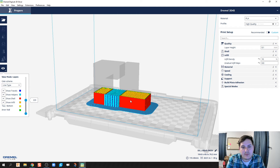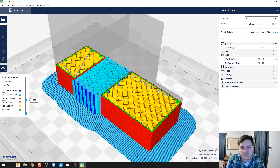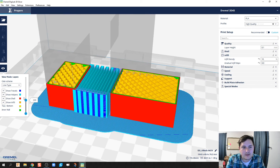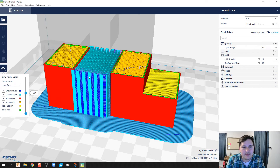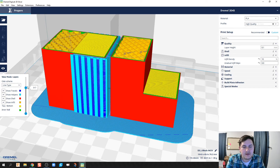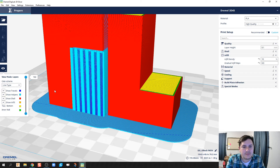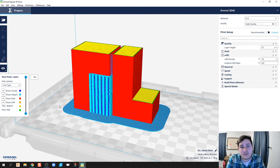If I click Prepare, the slicer will slice the model layer by layer to tell the 3D printer how to work. If I click the view mode and show layers, we can see as the printer goes up: there are the first support layers, the first adhesion plate layer, and then good adhesion. As it builds up, the red is the outside surface, the yellow is the infill — so we have 10% infill right now. Continuing up, the support layers support the first layer of actual object material, and then it ends at the top. Typically, you want the least amount of support possible — don't waste that plastic.